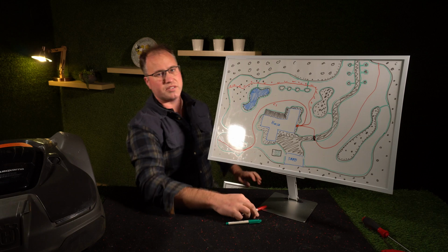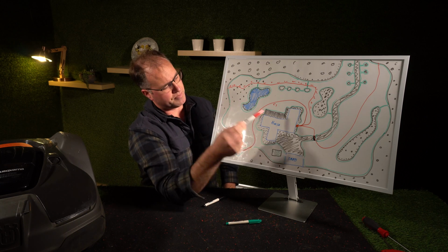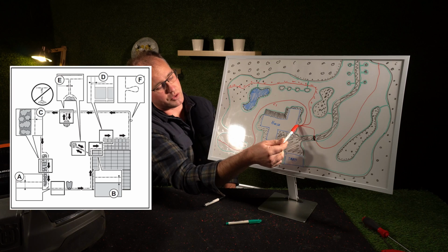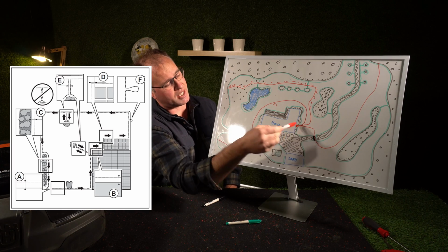So it means that the guide signal is not going to feed into any of the islands, and that is because of one key factor here. The signal from the charge plate comes out of the left and onto the boundary and loops around anti-clockwise around the whole install and then comes back in.